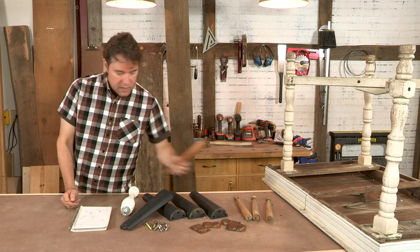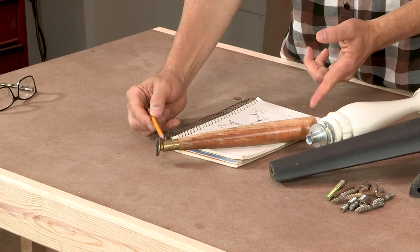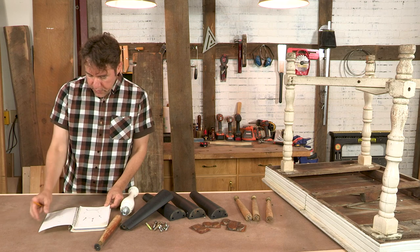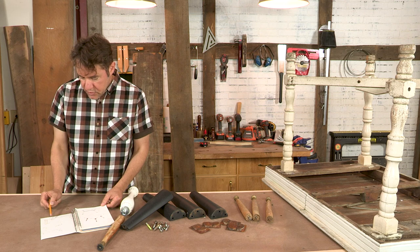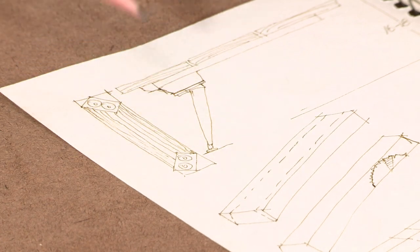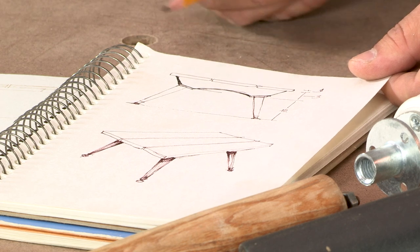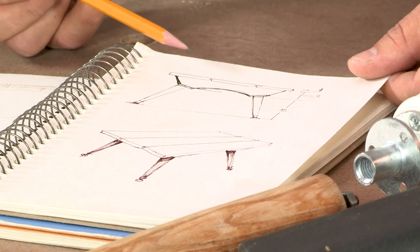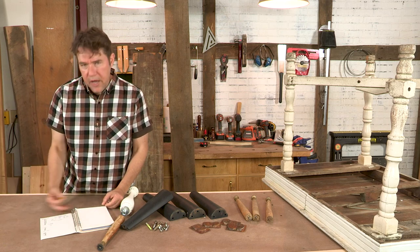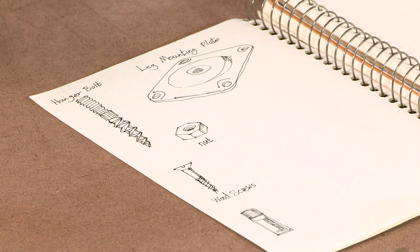As a designer, I really like that. For instance, when I looked at these legs — which are beautiful but maybe too short for a coffee table, just about 11 inches long when a coffee table needs to be 16 inches high — I came up with a proposal. One option is to add a small piece of wood to lengthen the leg and assemble it to the batten. In this case, the batten itself becomes more like an arched beam, so that when the leg is connected to it together they provide the right height for the table. The hardware can be a variety of options and we'll probably go with the simplest way possible.